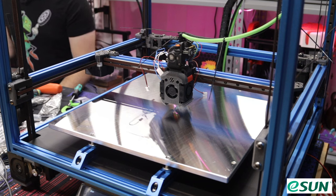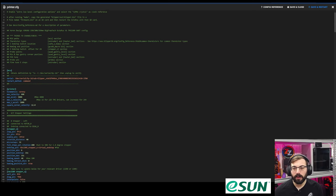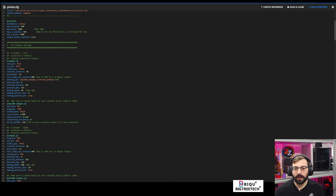I might decrease that a little bit more. This is an LDO kit so I use the LDO config and I've started to modify it — it's very fresh, I just got this working today. Looking at the X driver sensorless value, it's at 110. I'm going to increase it until it homes and just slowly stops at the end, and run it like this for a while to make sure that value is good.